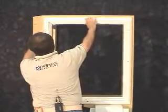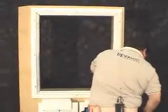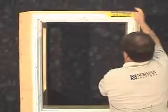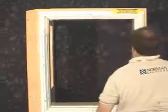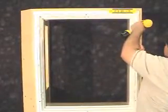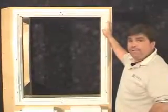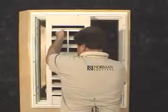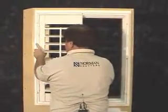Note that we've put the outside of the frame to where we measured our casing. Now what we'll do is level the frame and install the right side. Now that our frame is level and secure, we can go ahead and place the panels into the opening. Simply remove the protective cap, place the panel into the window and slide it over.